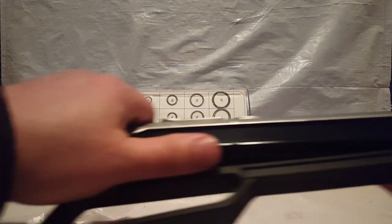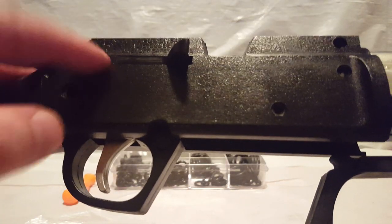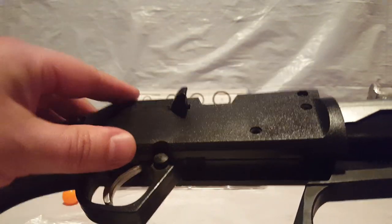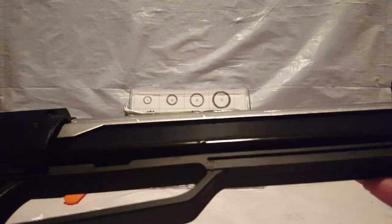Now the gun is cocked, because you have to have this gun cocked. One thing I want to make sure is that the hammer's down when you're putting these receivers back on, or it will not come back together. You can even break something. You've got to make sure the hammer's down and watch that pin when you're putting on this side. So now we've got to pull the trigger. Okay. Now it'll go in no problem.